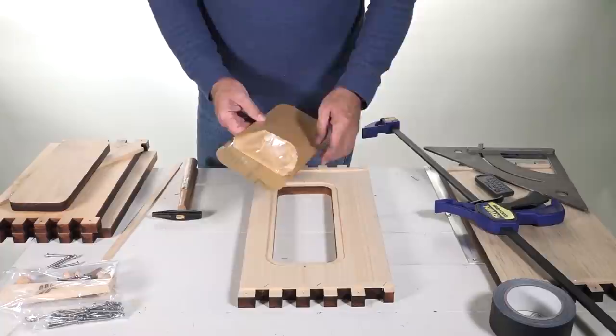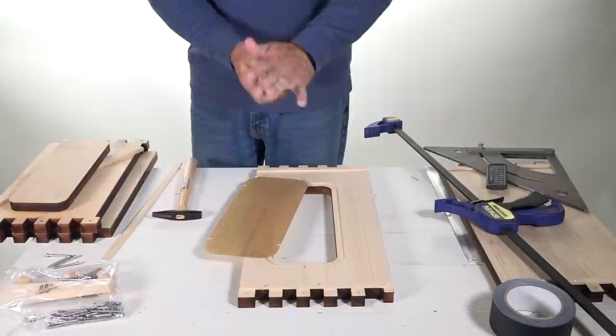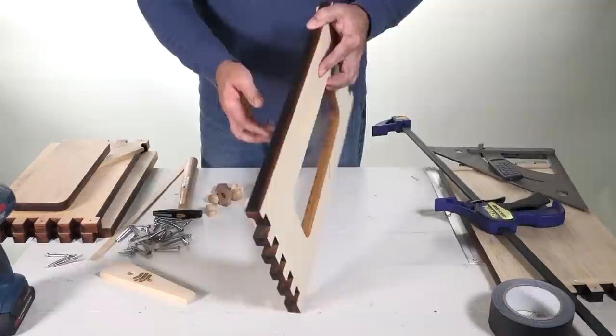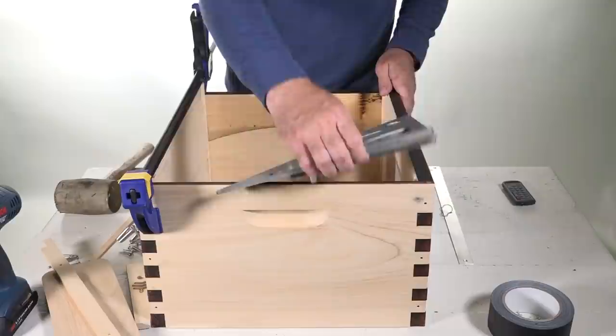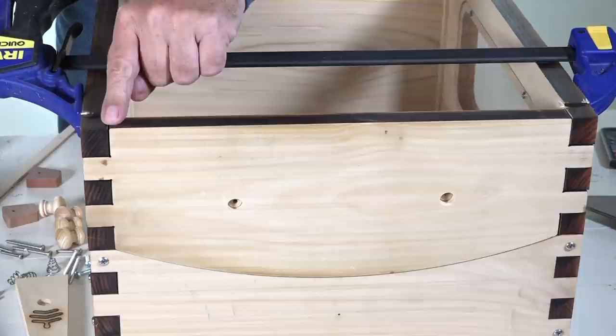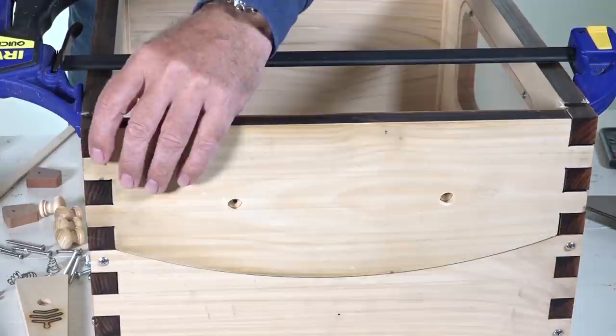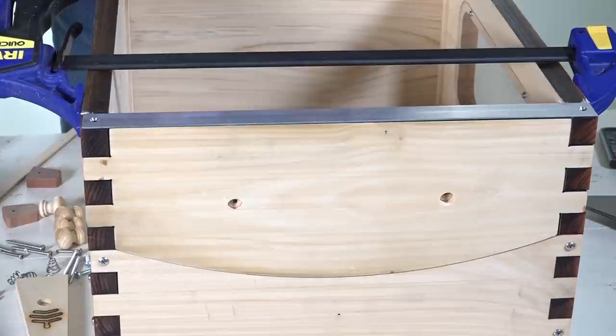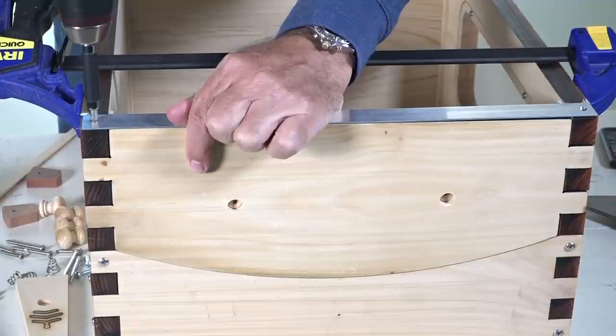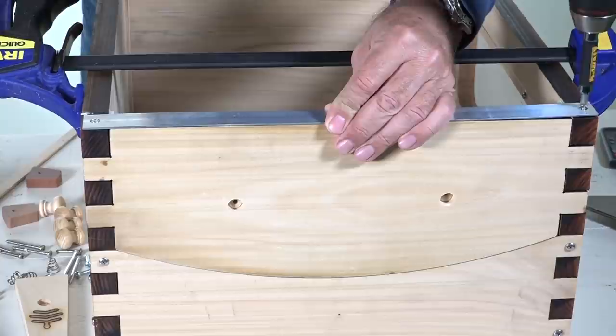You get the plastic window that allows you to observe the frames on the side, and it comes with paper on it. The shortest screws that come in your kit go for that window. The window cover that comes with this is thicker than the one that originally came out. Again, square everything up before you start using screws, and I also put these quick-grip clamps on there. Leave gaps on the side — remember this piece with the two holes in it has to be easily removed. They recommend shimming that with a credit card while you put this together to make sure you have the necessary space. There are two screws that are countersunk, and you'll see that beveled head matching the countersunk part of the metal strapping that holds the position of this box. Again, be very careful not to over-tighten.